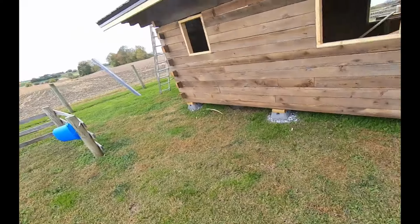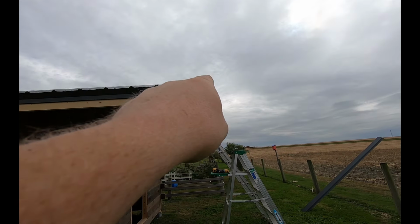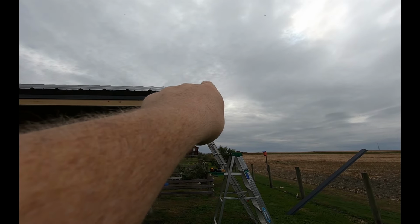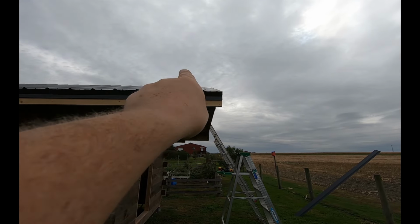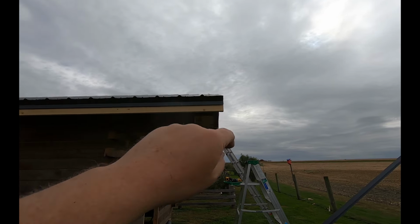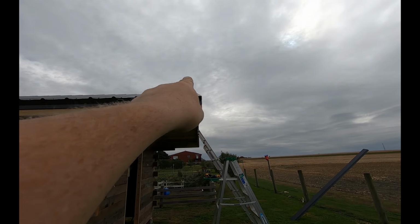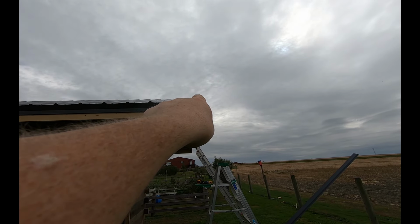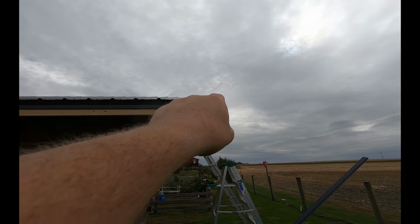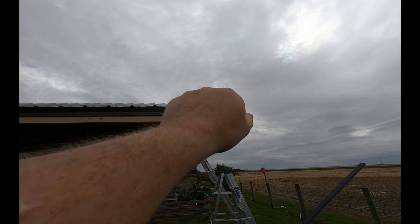Now, over here on this gable end, I don't have anything supporting it. You see, the last rib is back about 9 inches. These are 9-inch on center ribs. So if I was going to do this again, I made my roof exactly 18 feet, like 10 inches, and that's not enough for that last rib to sit here. So do a little better planning on that, or I've got a little trick here, or you could take care of that with a furring strip.